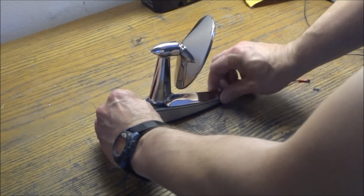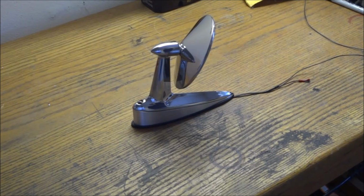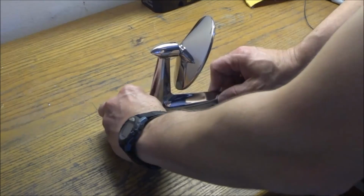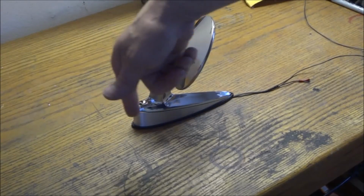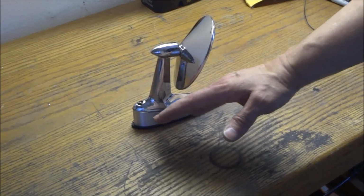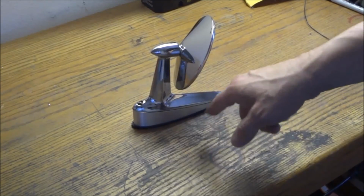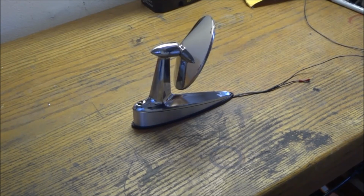And I used some of the CAM functions from that program, and it's way too aggressive for the X2 mini mill. But I was able to make some changes in the parameters and get it to cut right. It has an adaptive clearing CAM function, which just basically goes around the outside in small increments, full depth of cut, until it gets to the profile. And so I had to bring that down to only go about a quarter inch deep. So I had to make like 5 passes around to get it, but it turned out good.